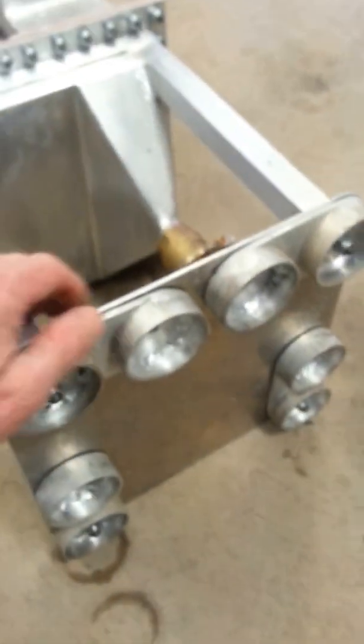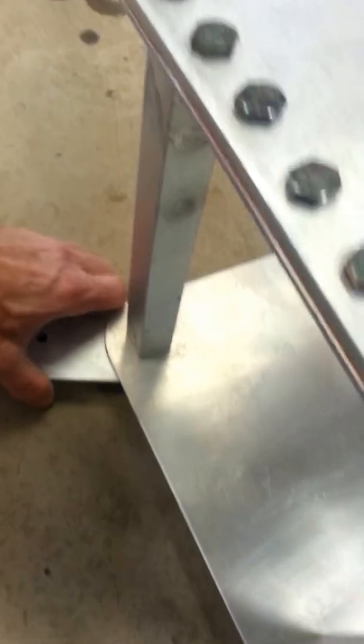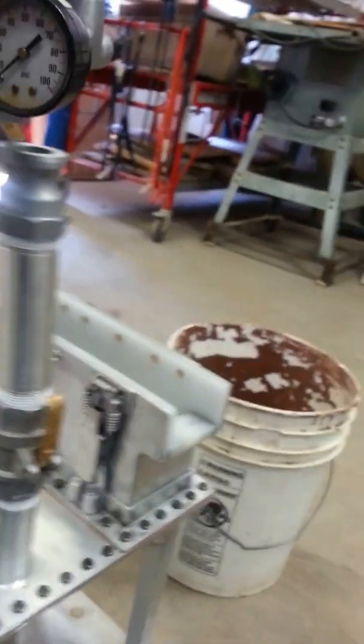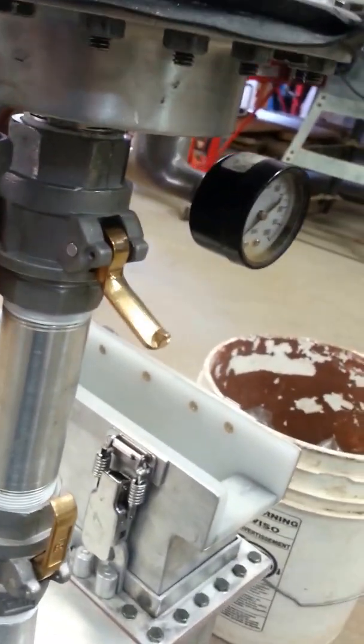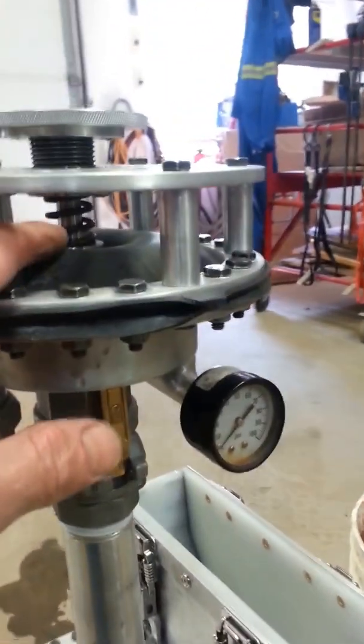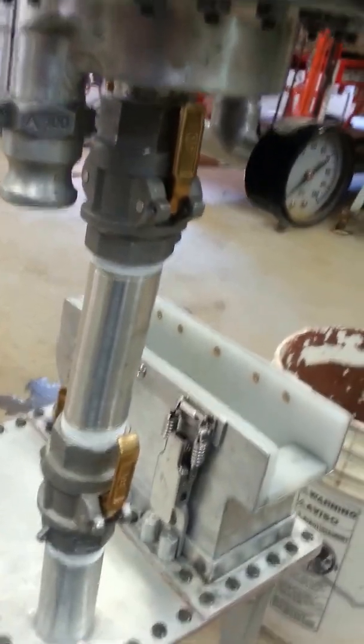For transport, on the bottom there are cup feet extensions to stabilize, and you can adjust them wherever you like. There's also a stand pipe to give it a little more height, which gives you more water weight to work with when the pulse valve is working. This pulse valve is not working — I'm having trouble with the valve seat up in here; it keeps leaking, so I'll show you how it works.